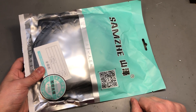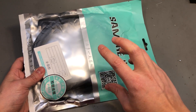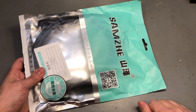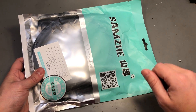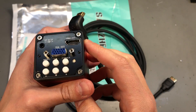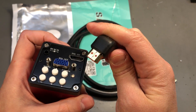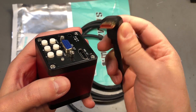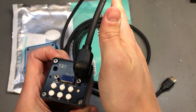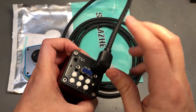Next I have an HDMI cable which is 3 meters long and has the connectors angled in a way that would work well with the position of the camera on my microscope. If you haven't seen the microscope review video, it's video 282 and I'll link it on screen right now. The original camera that came with the microscope had the HDMI port facing up, so I got this specific orientation to route the HDMI cable to the back of the microscope in a position that would not interfere with me working.